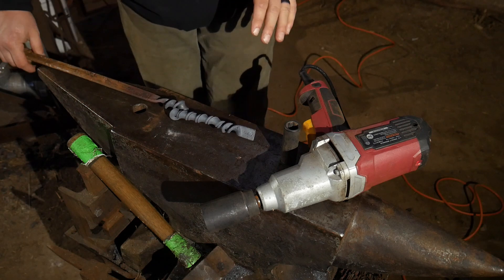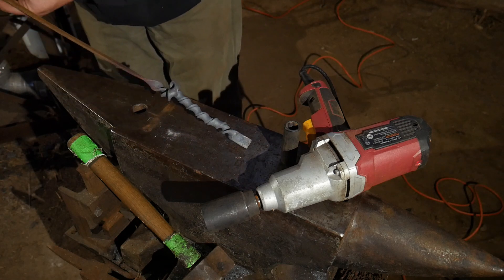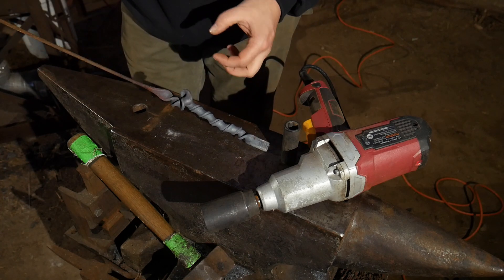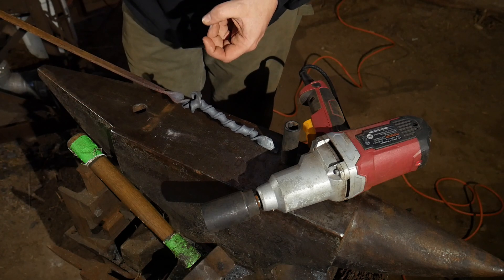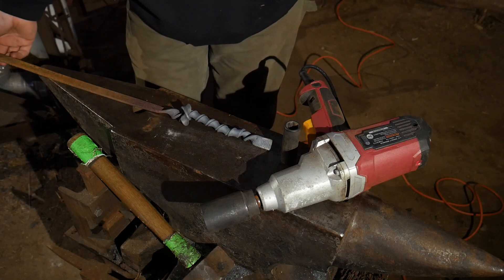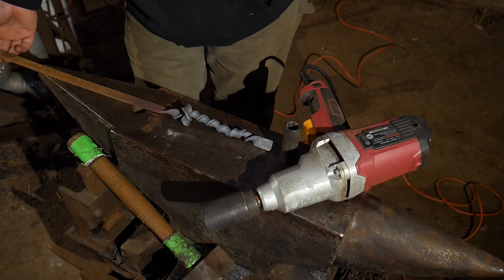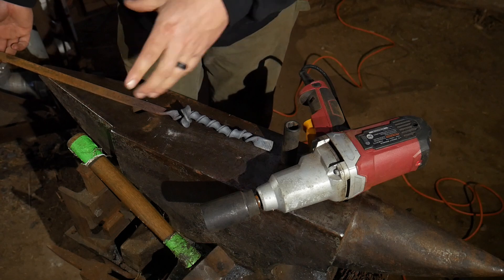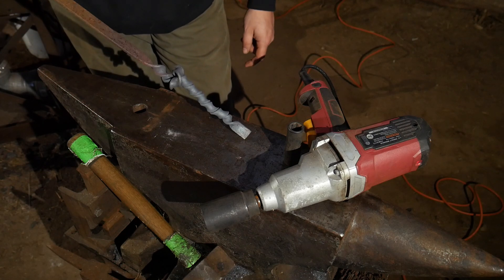Now, one great way of doing that — that I've been told to keep something like this straight — excuse me, it's still hot — is to take a piece of tubing that fits just over this end, just slightly bigger on the inside diameter to just slip over the bar there, and then go ahead and twist it. What it does is it stops it from running up and down. You can go ahead and hook on the end of the bar, throw your pipe over, hook on the end of the bar, give it a goose, pull off the pipe, and there you go. And this whole section in here would end up being nicely twisted.